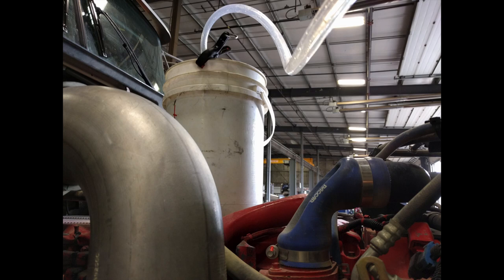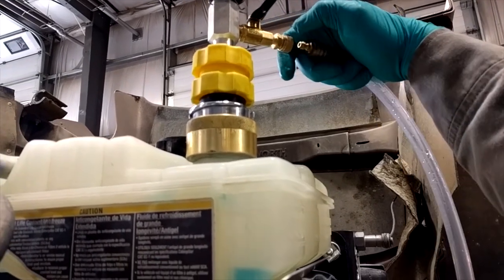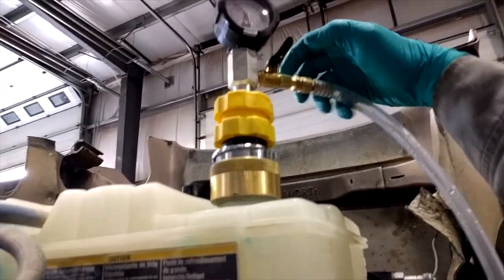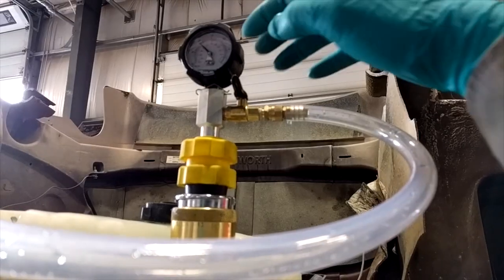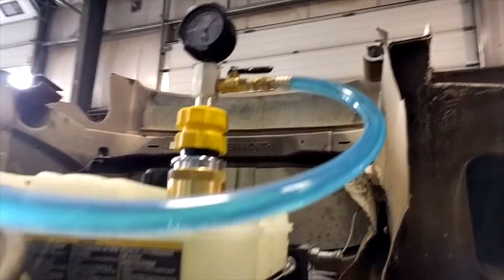I like to set my pails of coolant up on the valve cover. I could make an extension hose, but then it's kind of slow pulling the coolant back into the system. Your typical 15-liter Cummins ISX usually uses about 3 pails of coolant — they're 5-gallon pails or 19-liter pails — so right around 50-60 liters of coolant. Then I plug my hose into the unit where I had my venturi plugged in, run the hose to the pail, open the valve up, and start sucking the coolant in. I usually put two buckets of coolant in and then pull a vacuum down again just to get the last bit.